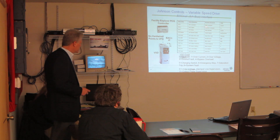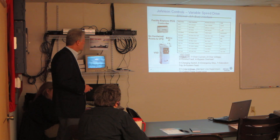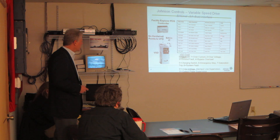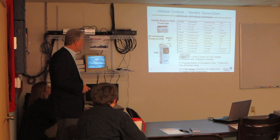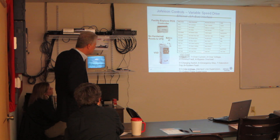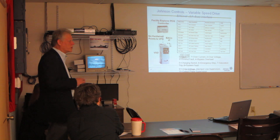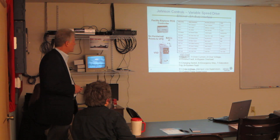All these points — which is really everything you would need — whether the drive command, whether it's on or off, the speed, if the bypass has been enabled, kilowatt hours, motor speed, speed setpoint, fault codes — all that stuff gets served right up over the SA bus without even adding points. So it's kind of nice.